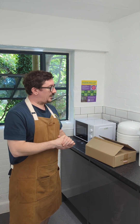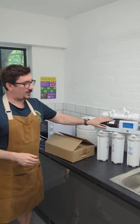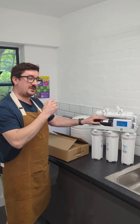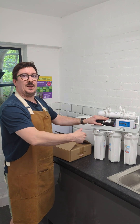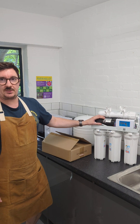What we have here is our pumped reverse osmosis system. You'll need this if you have lower water pressure in the property. For the standard system, you need 2.7 bar or above. If it's below that, then you'll require the pumped system. The pump isn't there to push the water through the tap quicker — it's simply there to push the water through the system so it's more effective. We're going to look at how to install this system today.